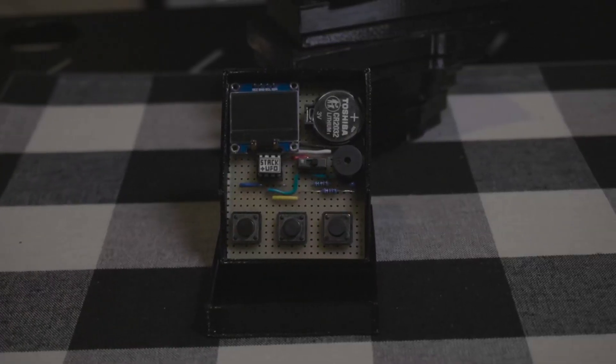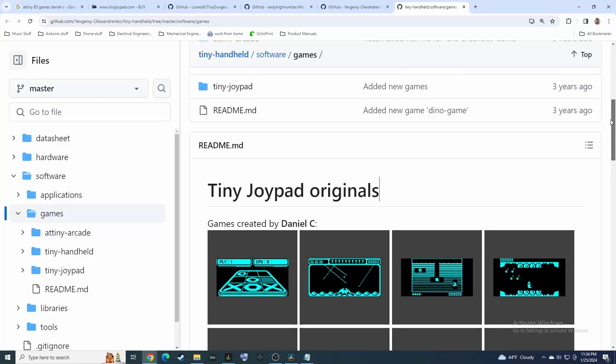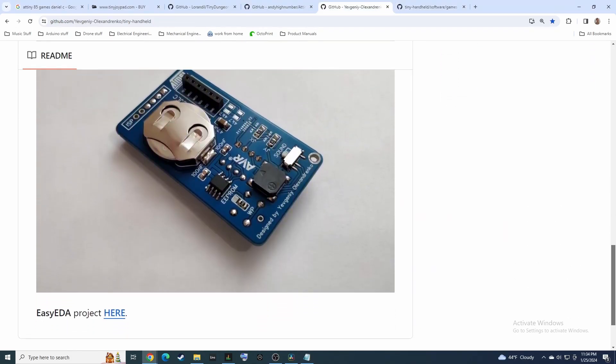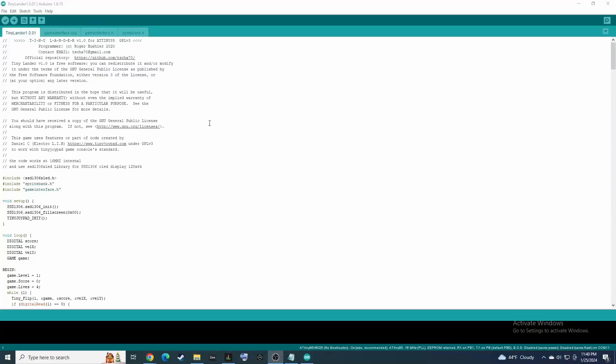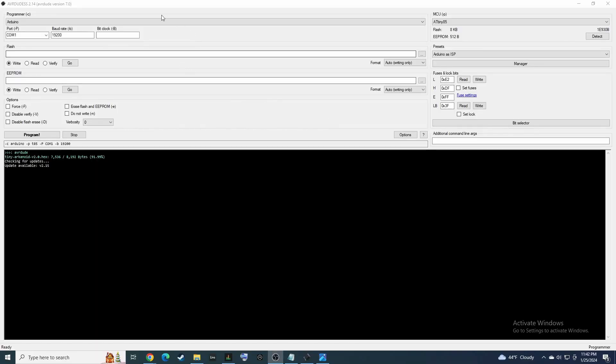I will be honest — I initially had a lot of trouble getting some of the code to compile, so I highly recommend using the pre-compiled hex files provided by Yevgeny Oleksandrenko, who I'll link to in the description. Using an already compiled hex file means you can skip collecting libraries and dealing with compiling errors. You will still need Arduino IDE to put the bootloader on the chip, but then you can use AVRDUDE to put the hex files for the game straight onto the chip. I ended up using a program called AVRDUDE-S which adds a graphical interface to AVRDUDE, so you can select all your options from a drop-down menu and click upload instead of typing command line stuff — really handy for a novice like me.